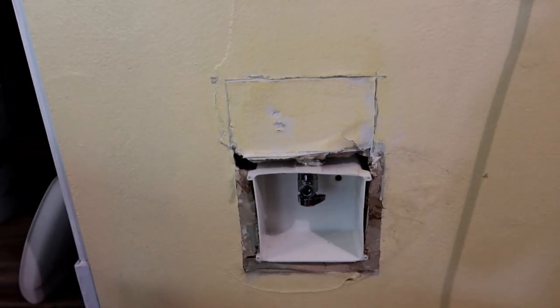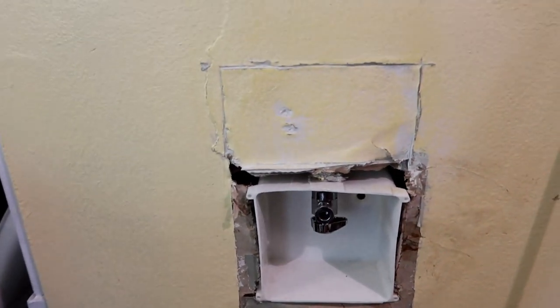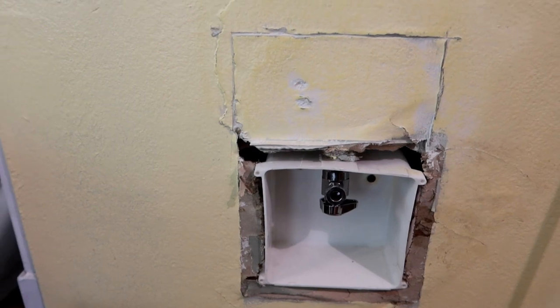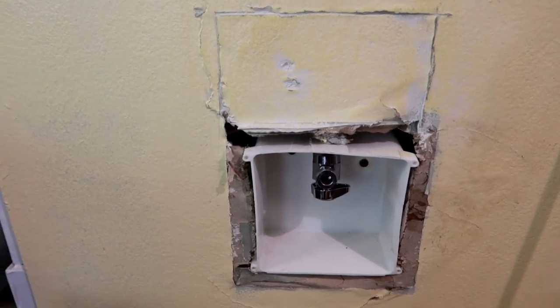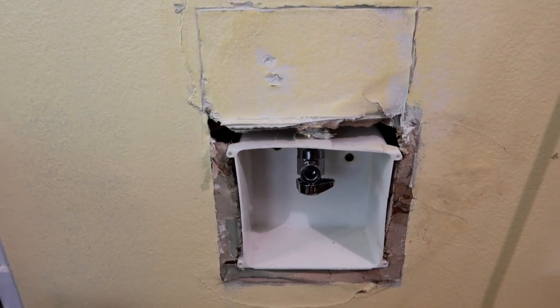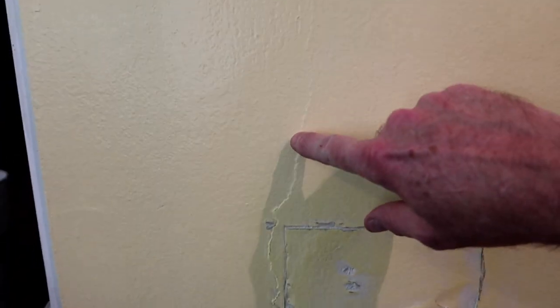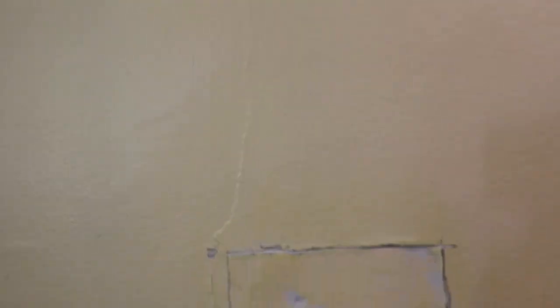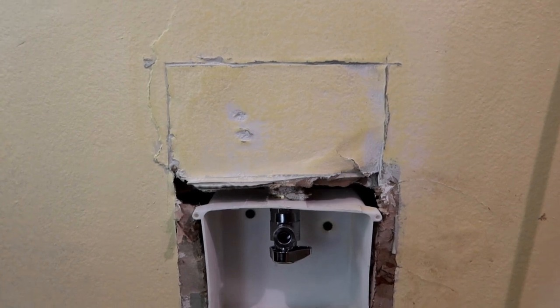We've given this a little bit of time to dry and I've gone over it with a fine grit sandpaper to smooth off some of the rough edges. Now I think I'm going to hit this thing again with a putty knife and try to do a little better and get this all nice and smooth. You can see that they've done something along here because it looks like the drywall ripped all the way up to here — there's a line on there. So this isn't the first time that somebody's done a little drywall work in here, and probably won't be the last.